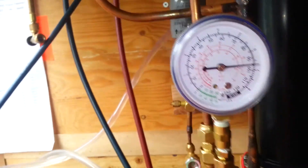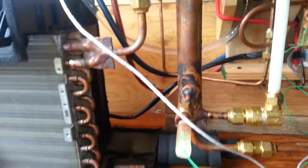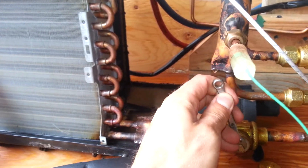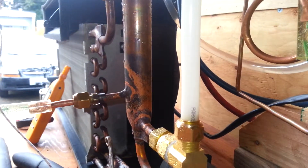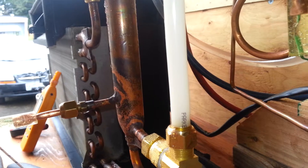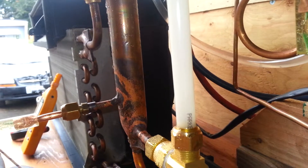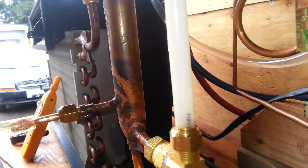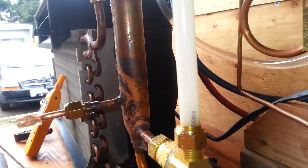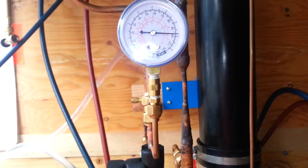Let's see where we're at — about 95, about 102 — about a 7 pound pressure differential, but you can hear the surging. If I open it up even more, you can see liquid in the sight glass here. It'll actually back up in the separator over here on the medium pressure side. So this is a hell of a lot of fun — 97 pounds, 100 pounds — yeah, we've lost some of our differential there.